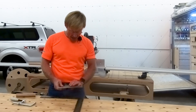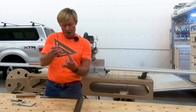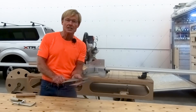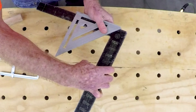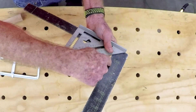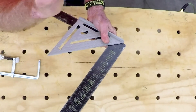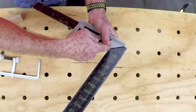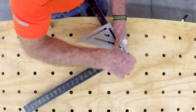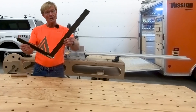Take your speed square. This 45 degree angle has a lip on this edge that you put up next to your square. Slide the 45 degree angle until it's right in where the framing square turns the 90 degree. Slip it back just a tiny amount to give room for your pencil to fit in there. Clamp it into place. That's the tool made up of tools that you already have.